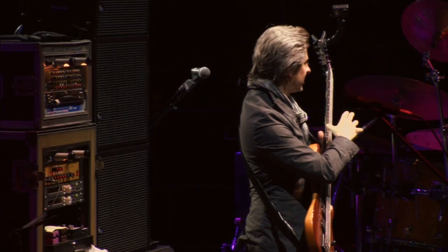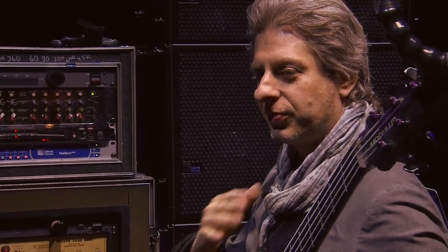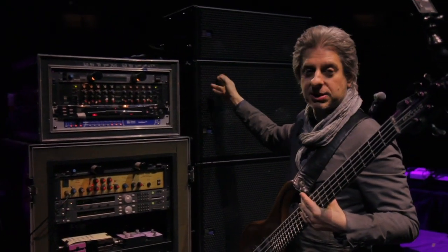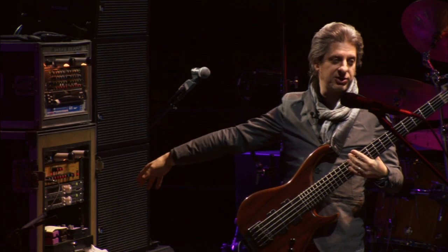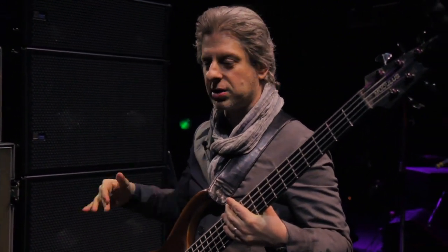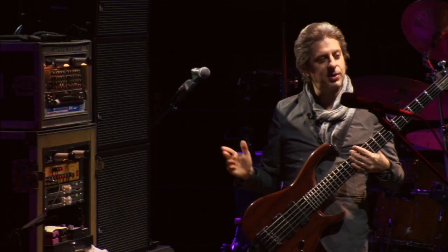Other people do things like put triggers on drum mics or baffles to keep other sounds up, but we don't do that — we keep an open feeling on the drum mics. All these speakers, by the way, are not just EQ'd but time aligned to each other. That means if one hits a millisecond before another, you slow it down so they all hit at the same time. It's a great sounding rig, but it's new — last night was the first night. I took six years to dial every knob of the last rig perfectly. I really committed to a softer stage sound to make it easier for the house mix and the other band members. Keeping the volume down and using a new rig combined was pretty difficult. I'm a fish out of water — no pun intended — and I'm hoping to grow into it.